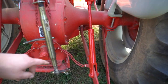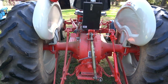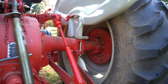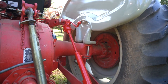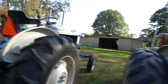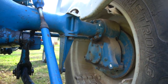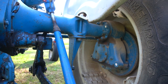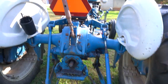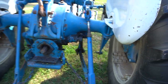It's kind of hard to tell without comparing side by side, but aside from the fenders being a little different and the way the axle goes in, these tractors are pretty much identical in the rear. The reason the axles go in straight is because it's a utility tractor. On the 4,000 row crop, you have drop boxes — that's how they achieve the extra height, probably about an extra 10 inches of clearance. The linkage differs a bit but it's still a three-point hitch category one.